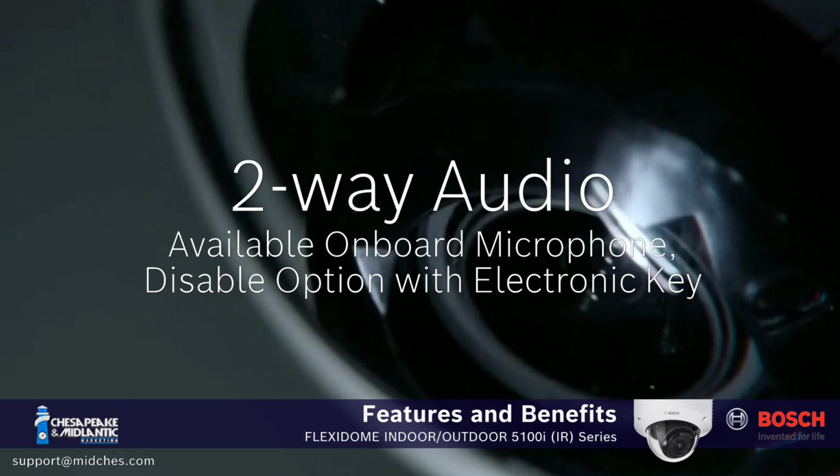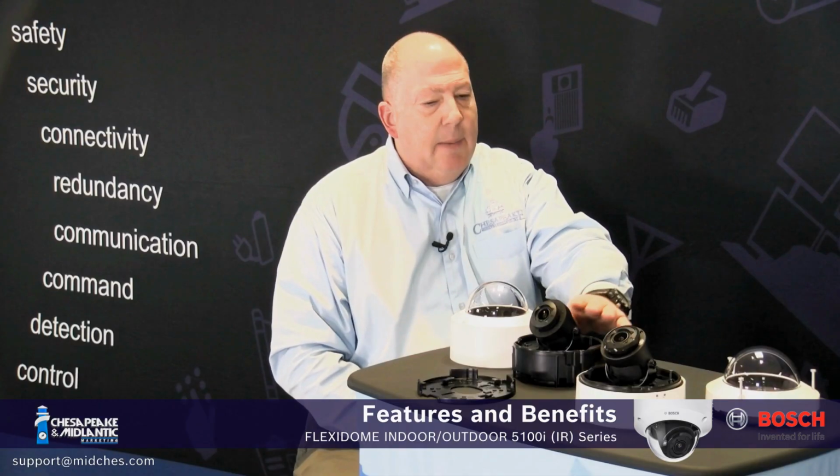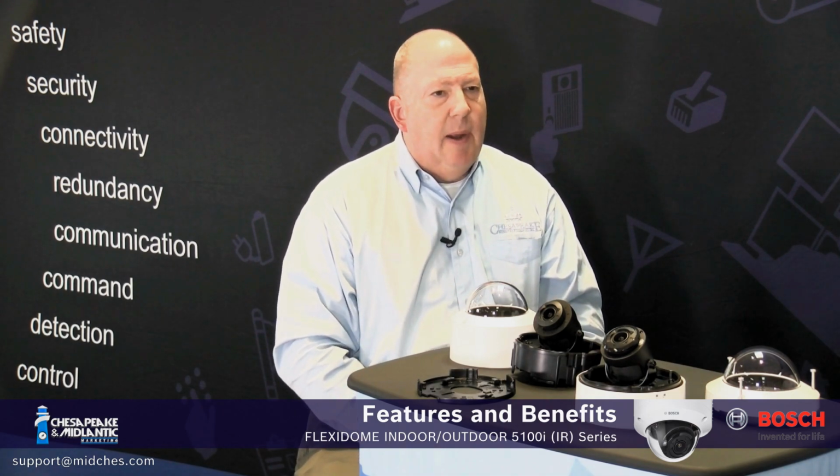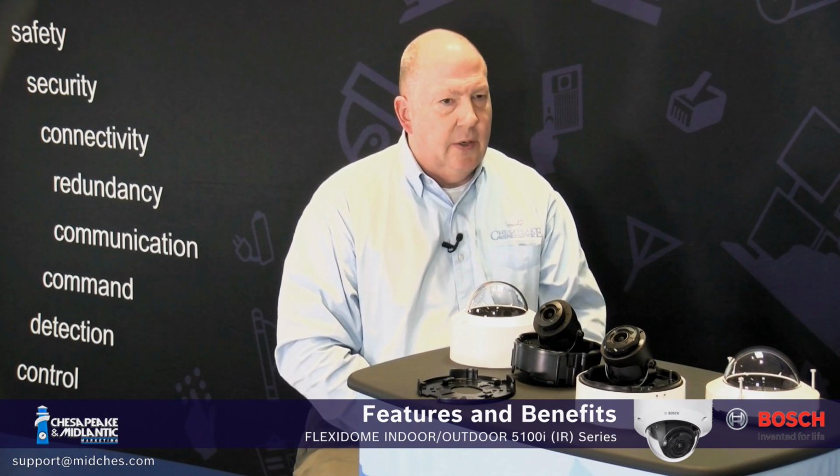The internal microphone in the IR models, we talked a little bit about that earlier. We have the capability to add an external microphone on the interior units and the exterior unit without IR, and that'll add a big plus to the camera. So anybody who's looking to capture audio, we can do that. Don't forget, if you don't want audio or you can't have audio, we have an electronic key that'll shut that off permanently, and that can't be turned back on in the field. So if you don't want that audio capability, we can shut that off completely, and that's a big deal to some of our federal customers and other customers that don't want audio capability in a camera.